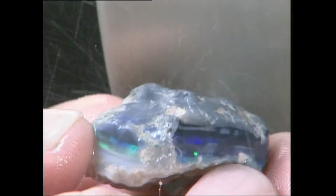Just cleaning off that little bit of skin and sand that's on the edge of this knobby. See our colour bar there, it's starting to look straight. That's it, looking down on it. What looked fairly rough is starting to show a bit of promise. Now we'll clean that around the edges a bit further. Even if you're fairly certain where the colour runs, it always pays to go around the knobby and make certain before you face the piece off.